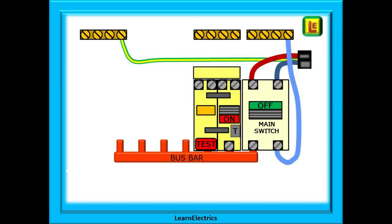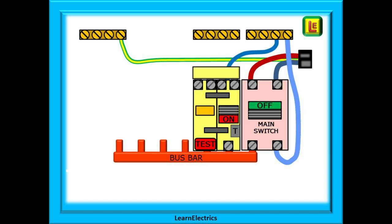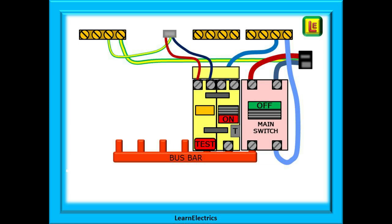Starting with installing the two-module unit — we've already joined the two halves together and this is now on the bus bar. Although it takes up two bus bar pegs, it only needs to take power from the RCBO side. Connect the pre-wired neutral tail into the main neutral bar. Now we can attach our circuit cables to the AFDD terminals — they cannot go into the RCBO as those terminals have been filled with the link between the two halves. That is the two-module device connected. If the power were on, pressing the test button would trigger a self-test and, if all is okay, a steady light will show to indicate the device is functioning.